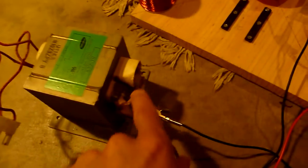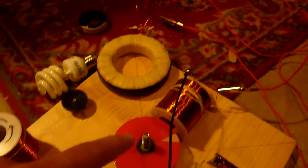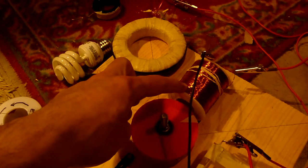The power source is this 9V battery. The plus goes into the low voltage side, comes out, goes to the other transformer, and all the transformers are connected in series to each other. Then it goes to this transformer — this is just a ring inductor — and then it goes into this air core.